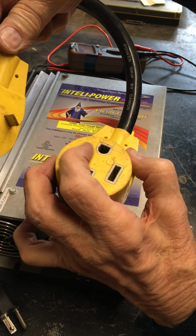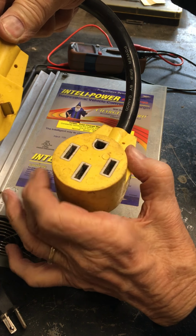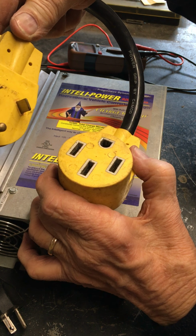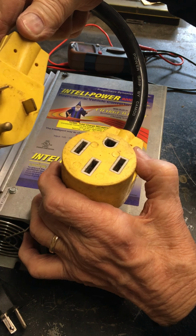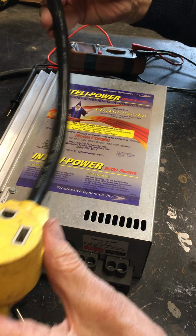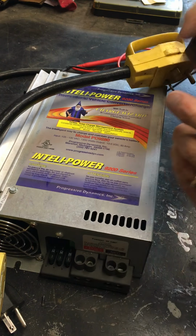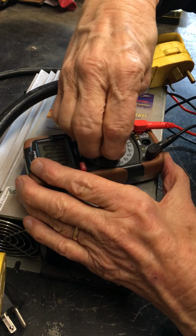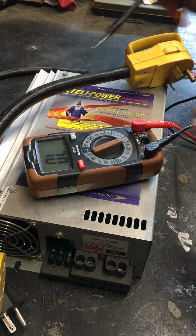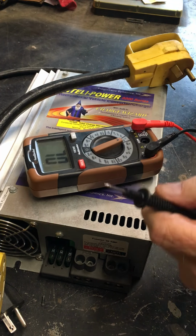It actually connects these two, so when you plug your trailer plug in with one of these, and you plug into your trailer, you can power both sides of your breaker box as it would in a 4-wire 50 amp regular hookup. I'll show that to you, as you can see here. If we can get this all in the picture, I'll take a continuity tester and put it on where you can hear it when it beeps. You can hear this. That means it's got continuity.